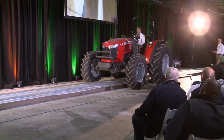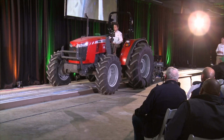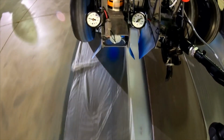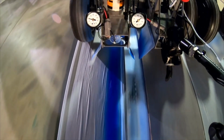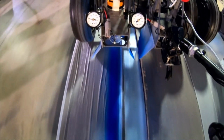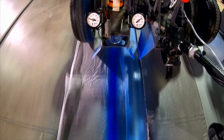So we're still in the soft soil zone here. And whoop, right there we changed, right? Row 2, the airbag pressure really increased compared to row 1, and paint jet is now painting on the ground, right? Indicating that row 1 is losing closing performance.